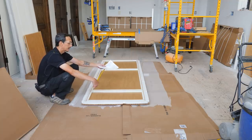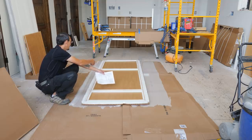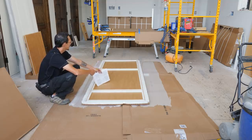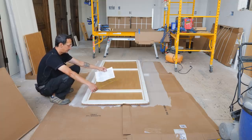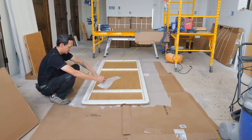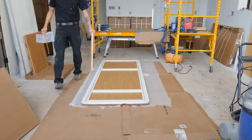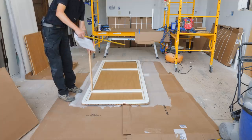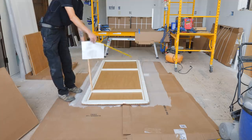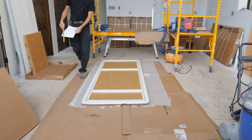But the way these work, like, this is gonna be a drawer. So we're gonna have a bottom, a top, and a double-sided, finished on both sides, middle piece here, shelf. And then they give you a big 3/4 inch adjustable shelf, they call it, but you have to mount support pieces underneath where you're gonna actually slide in your oven, and that's these. So they'll kind of go like that, and then I'm gonna have to build or cut my own piece for the back, because I want this shelf supported on all three sides, because that unit is about 250 pounds for a 30 inch wide oven, and this needs to support that.